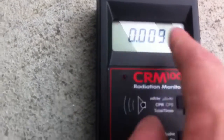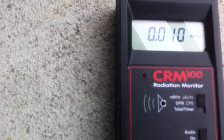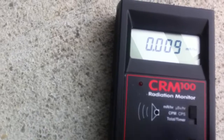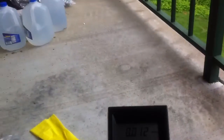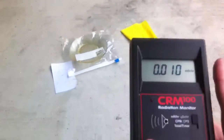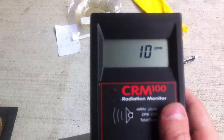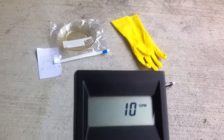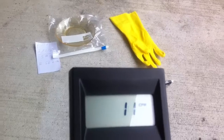In millirems per hour, you'll notice how the math works — that's pretty simple. You divide by 1,000 and you get millirems. That's for my Geiger counter, and there are various things that affect that, such as the size of the tube — a bigger tube will always read more counts. For example, if I had a Geiger tube inside here that was double the size, then instead of reading 10 counts per minute it would read 20. That's not because there's more radiation, but because it's double the size, so it has double the chance of seeing it. It's like having a bigger eyeball — you'll see more light.